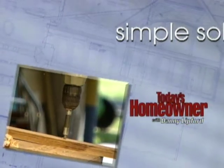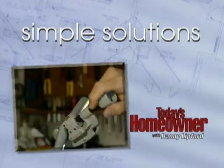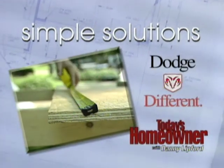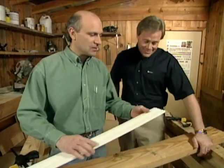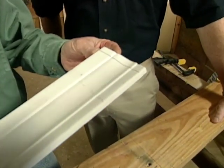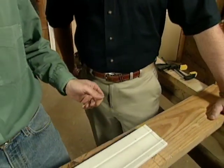Get ready to review your fix-it list as Danny and Today's Homeowner magazine repair and maintenance editor Joe Truini show you this week's simple solution. Probably the best way to cut trim is using a motorized miter saw, but most homeowners won't have a saw like that. Joe can show you how to use a hand saw and be just as successful. The problem is when you're using a hand saw to trim only a half inch or so from the end of a piece of molding, the blade will flex and pop off the waste piece, leaving a ragged, jagged cut.